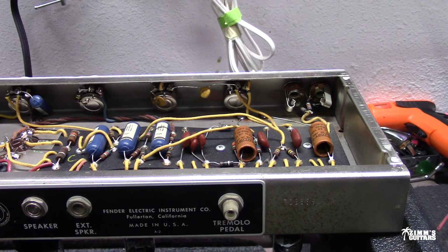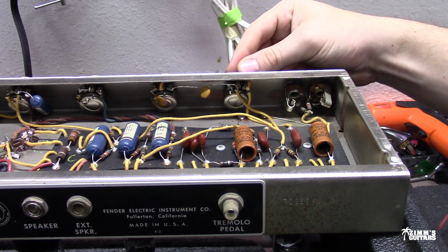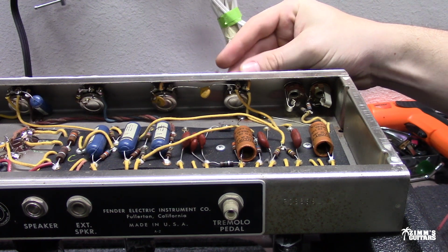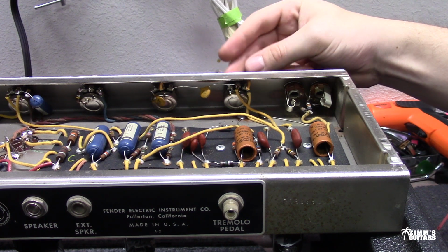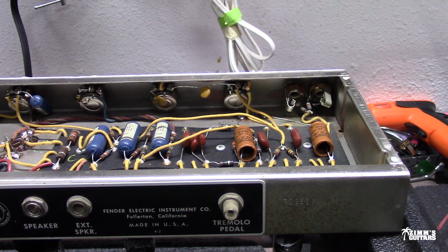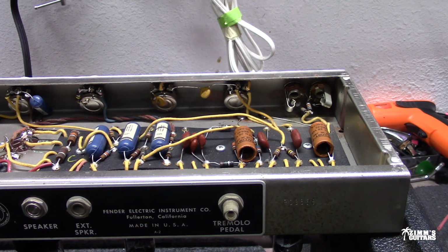The volume increases, the gain goes up quite a bit, as you'd expect, and the amp just seems to become a little more alive. Well, if you replace it with the 1 meg pot, it's going to be more responsive earlier on in the volume on the control here, because the range that it's sweeping is a lot larger, so it kind of hits that spot early on in the volume. So this is something I may consider swapping out, putting in a 1 meg pot, but we'll have to save that for another day. We're going to put the amp together, and maybe we'll try swapping out the speaker and see how that sounds. We might have another Jensen that we might try and replace with, and check in for that.